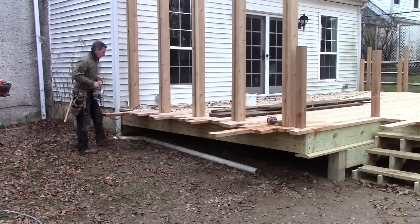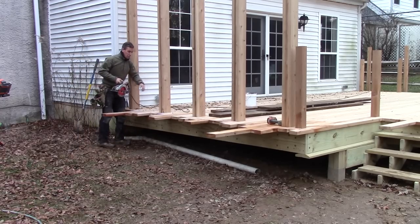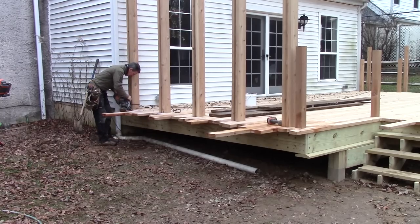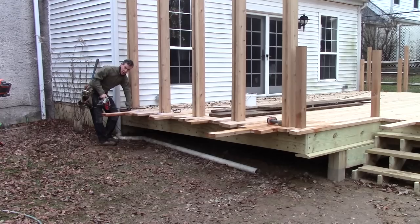In this episode within an episode of the DIY Pro Show, this is where I cut the boards and make this snaggletooth run look like a deck — it's one of my favorite parts. I left the first ones cut to the length and overhang that I want. Then the rest of them: snap a line, cut my way through.